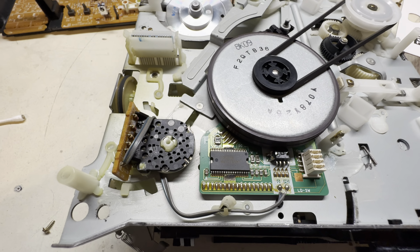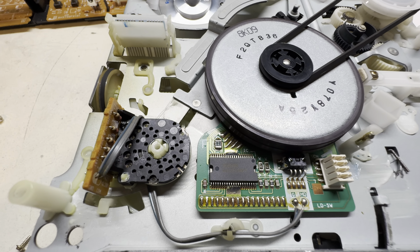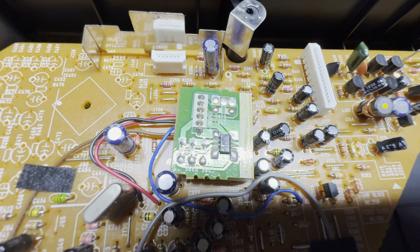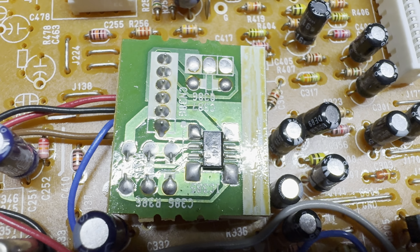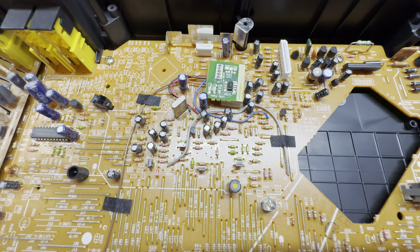The contacts are badly oxidized so I'm going to have to clean them and hopefully fix the problem and get this machine working. I went ahead and got rid of the tarnish on the contacts and cleaned them up, same thing with the wipers — they're nice and clean. I also bent them a little bit upwards. Now I'm going to spray a little bit of DeoxIT and put it back together and hope that it works.